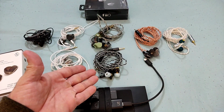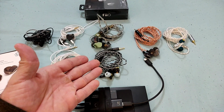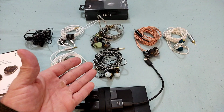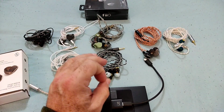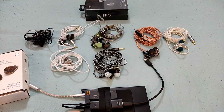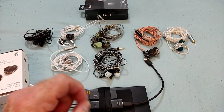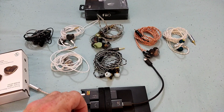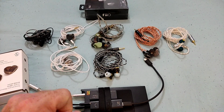And that's the same thing that happens here with the Warrior. This ridiculous amount of mid bass that they've put on it just spoils the IEM. And again, I retuned it. I did exactly the same mod that I did on the Rosefinch. In this case, it was actually a Y4, not a Y5 or a Y6. I plonked a Y4 filter on the dynamic driver and put a 400 grade filter on the nozzle.